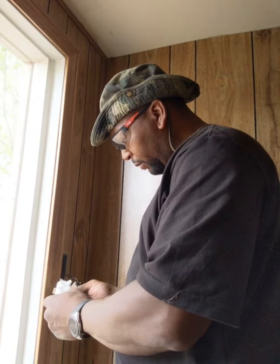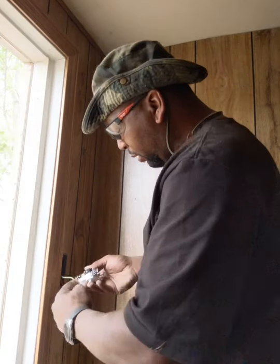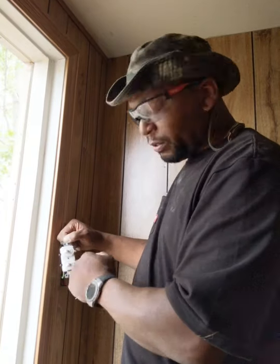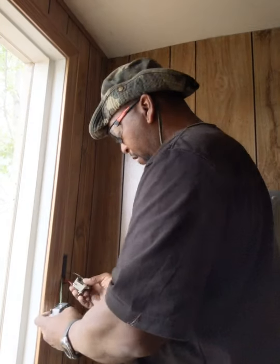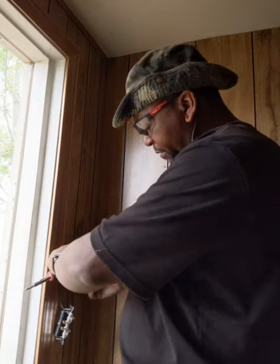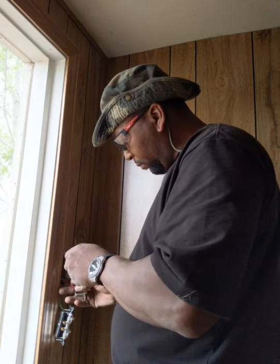Alright, just check in. The ground faces the bottom. Because you have two switches, they're sideways instead of up and down. On will always be to the left. Off will always be to the right. So what I'm going to do is hook the left side lead up first. Now the left side lead is on the bottom screw, so that's where I'm going to put it back, on the bottom screw, on the new light switch. So unscrew that.